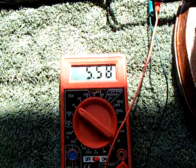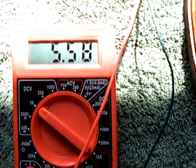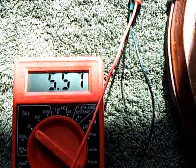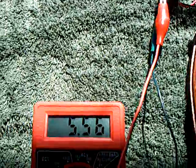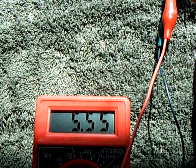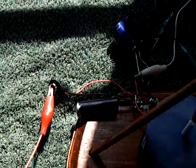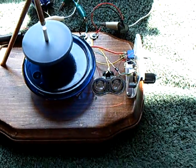You can see the cap came back up — I'll disconnect it again and watch the cap go back down. Capacitors are a really good way to see what's going on because batteries have a tendency to mask the energy being consumed, whereas a capacitor is pretty straightforward.